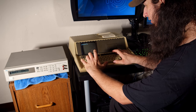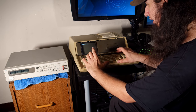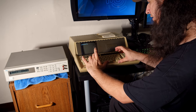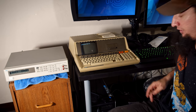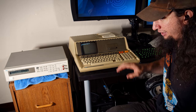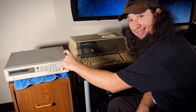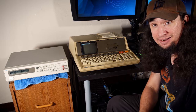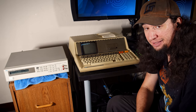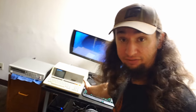What I'm going to do is send a command — 'VSET' — and let's set it back to 15. Now that it's been power cycled, it doesn't have that voltage set anymore. We can see the voltage is currently 0. If I hit enter... it is now 15. This thing just set the voltage on the power supply. Now that cable going to the back can only connect those two together, but that's not quite the end of this. So that's the HP85 connected to the HP6633A.